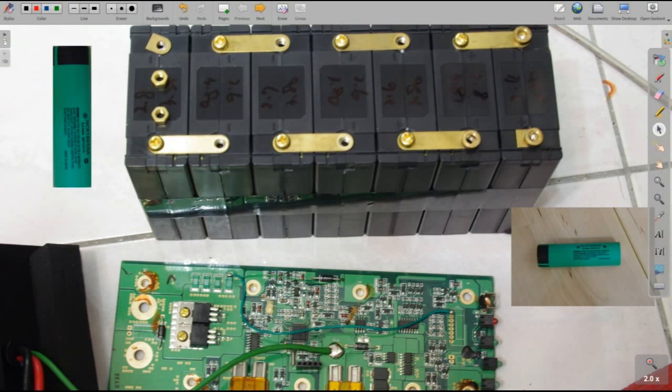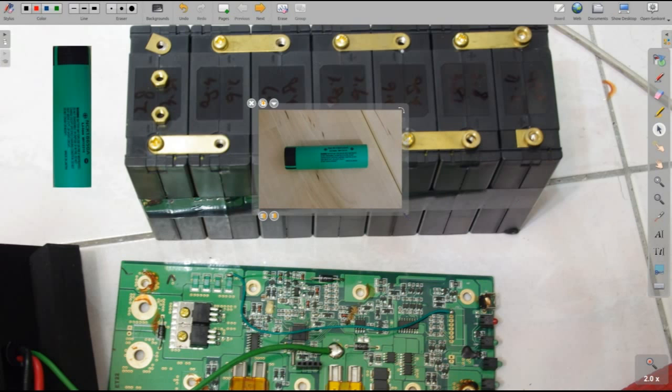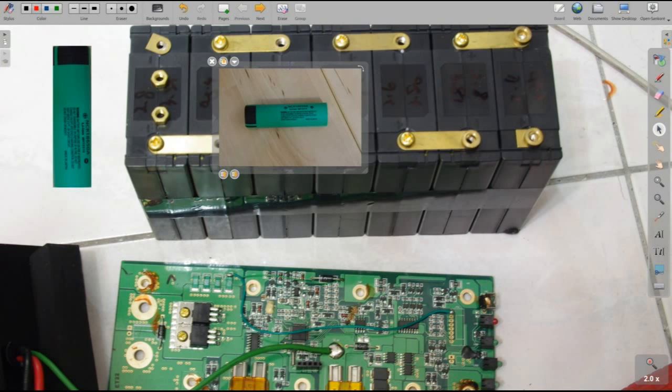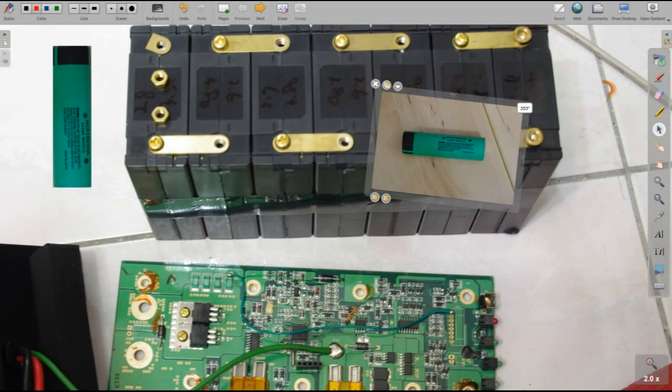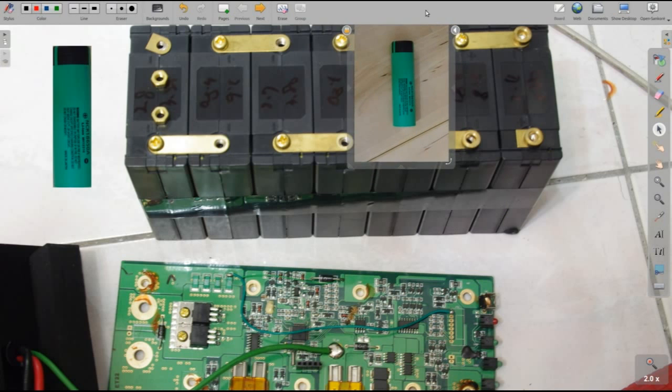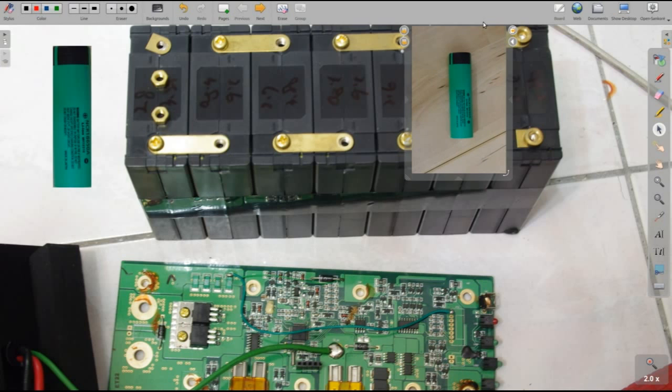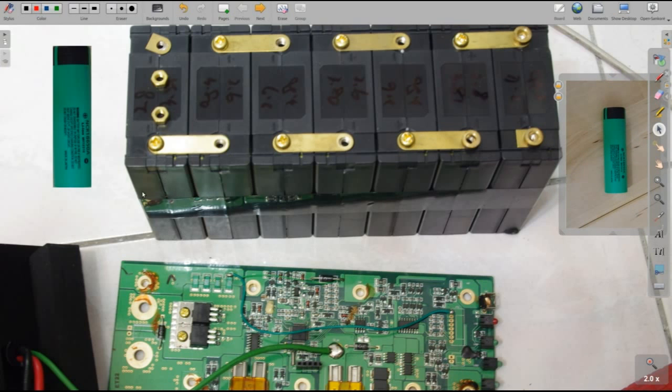And so I decided to take my old circuit board here and build my own pack using these 18650 battery cells. That's, I think, a new standard in the industry, and they are 18650 Li-ion battery cells. This one is from Panasonic, made in Japan. It holds 3100 milliamps, and I think they used similar ones inside this pack here. I couldn't look inside, but because the size matched exactly the width of the board and the width of these plastic packs, my thinking is these kinds of cells were inside, maybe 5, maybe 6, in parallel, and maybe 2000 milliamps at that time.